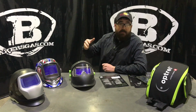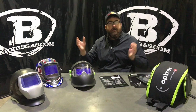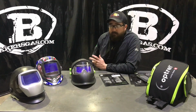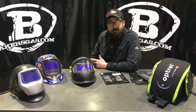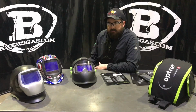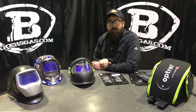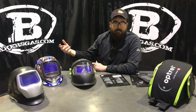So to touch on your clarity rating, the 1112. Everyone's all hot to trot on this 1111 or 1112. These three are very big brands in welding helmets. They chose to go with the 1112. So the last number is for angular dependency, which is the way that the light scatters when entering the front of the welding helmet. So as it passes through your auto darkening lens, that's what the last number stands for.